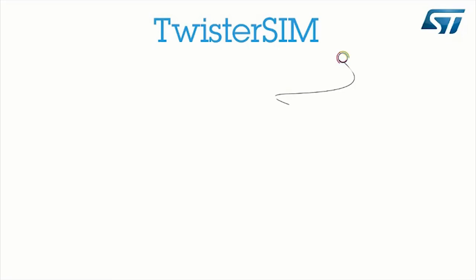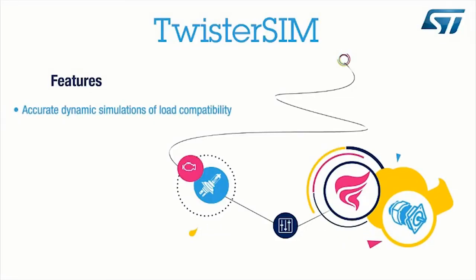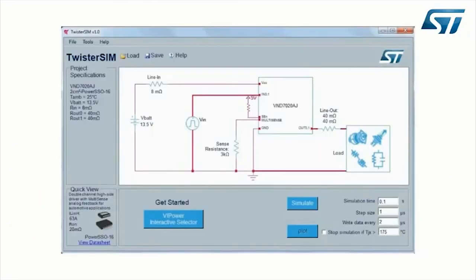Getting started with TwisterSIM Simulator. With this video, you'll be introduced to TwisterSIM, a unique electrothermal simulator for devices in VIPower technology that allows complex evaluations with accurate dynamic simulations of load compatibility, wiring harness optimization, fault condition impact analysis, diagnostic behavior analysis, and dynamic thermal performance. Simulation results, including junction and case thermal profiles, load current, and diagnostic behavior, are shown on dedicated scope views or exported in a number of different commonly used formats in just a few clicks. TwisterSIM has an interactive selector that pre-selects suitable devices based on first-level system requirements, and it assists in describing your actual system configuration with layout, load, and driving profile customization to build an accurate model of the final application.